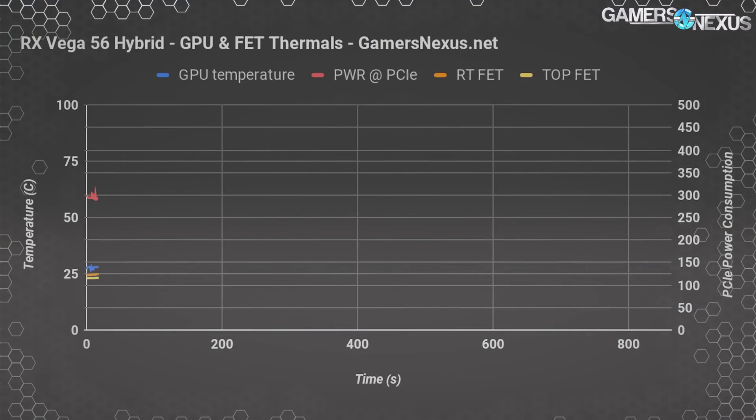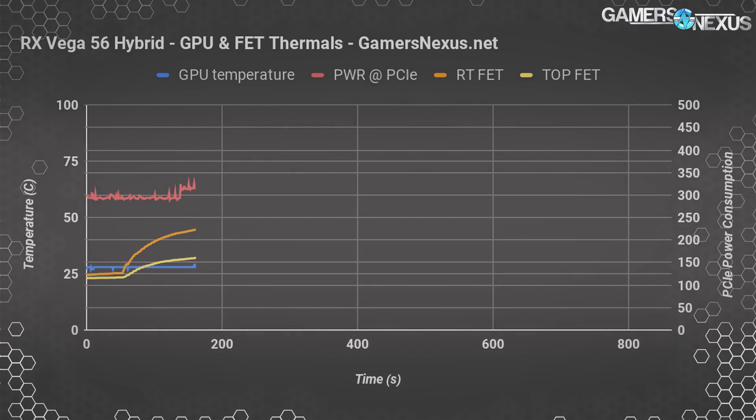We started crashing at 1762 MHz, so we're definitely up against a stability wall. Even in the livestream pushing 406 watts, we couldn't get beyond 1742 MHz. For Fire Strike, 1742 MHz is the final number; for games we had to drop to 1732 MHz since 1742 is not stable there. HBM2 stays at 980 MHz for stability, though some tests like Fire Strike completed at 990 MHz.